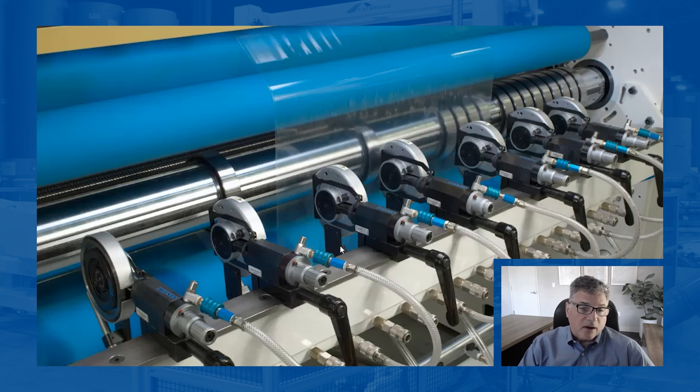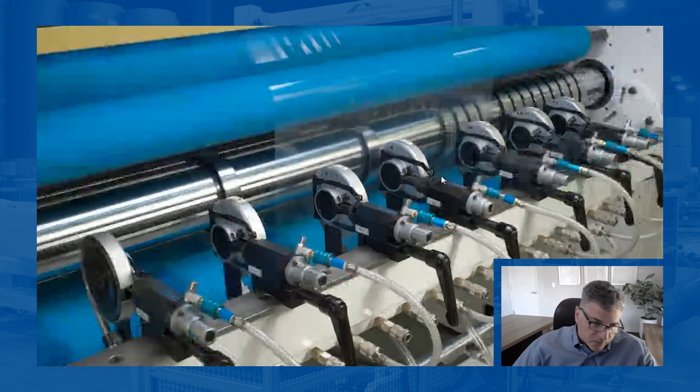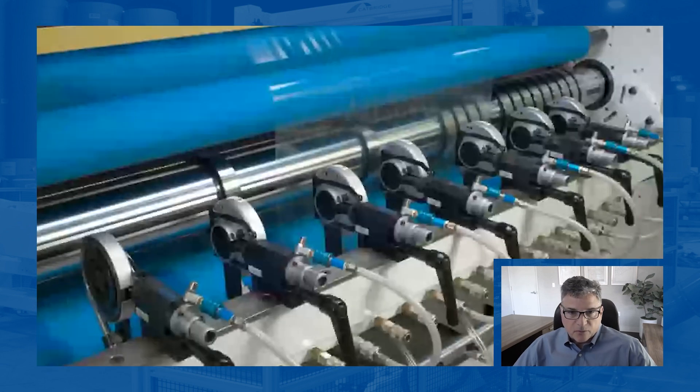When it comes to foils, you don't want to roll that edge because the foil could be soft even if it's laminated with film. Getting that double hollow ground tightly in there means the least amount of material that has to bend around that male knife as it's in contact. You're looking at some thermoform material here with wide rim holders — that's really what's going on in this photograph.